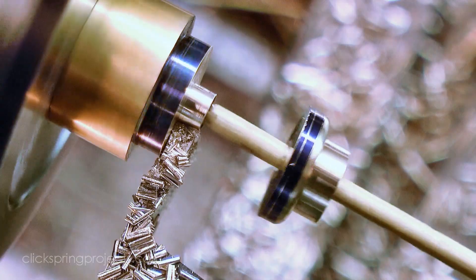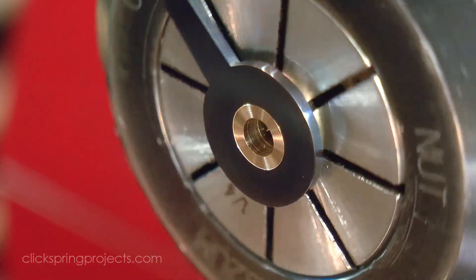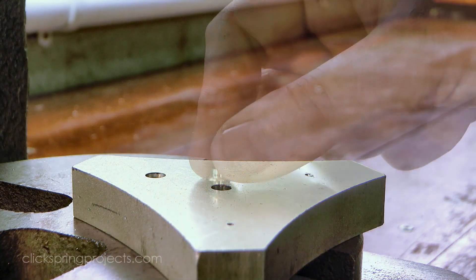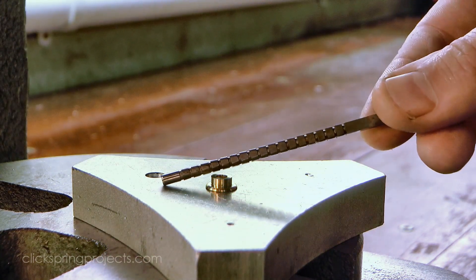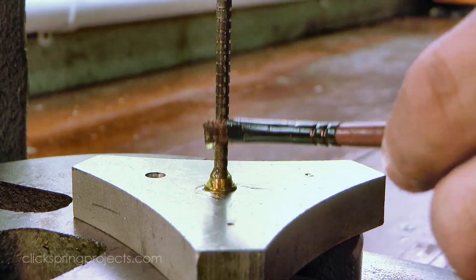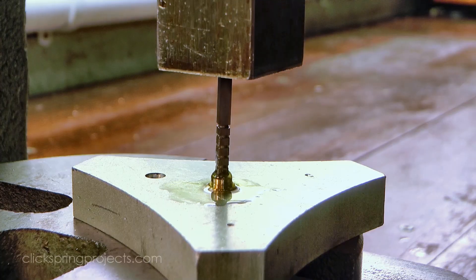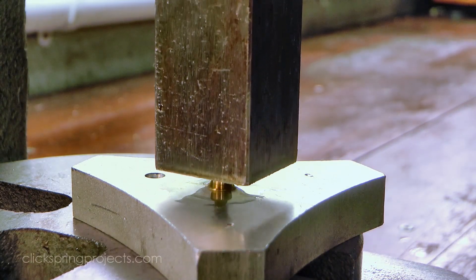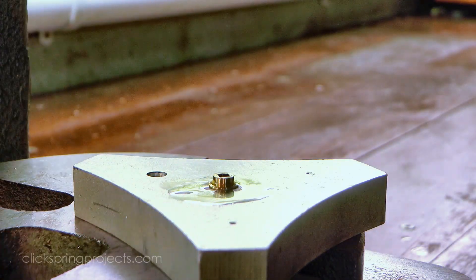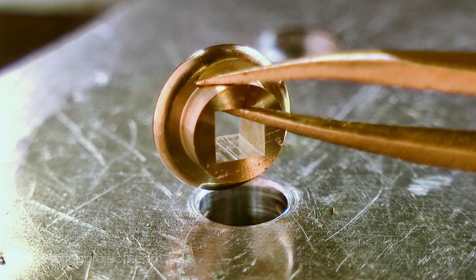The tricky bit to form of course is that square hole, which needs to be dead on center as well as perfectly square. A rotary broach would work well if I had one, or perhaps I could use files like I did for the ratchet wheel, but instead I'll be using this arbor press and a custom made push-through broach. The center hole I drilled is a close fit for the pilot diameter of the broach, ensuring the cut is on the axis of the part. With a generous coating of cutting fluid, the arbor press pushes the broach through — the result is a well-positioned, dimensioned square hole with an excellent surface finish. Click on the link to see the video showing how I made that square broach.